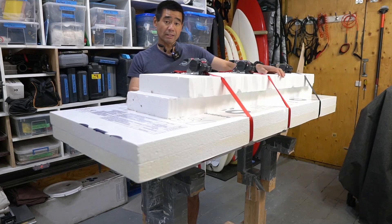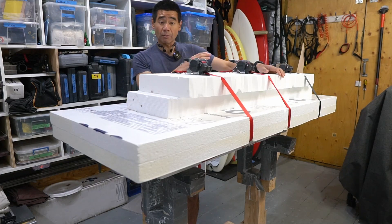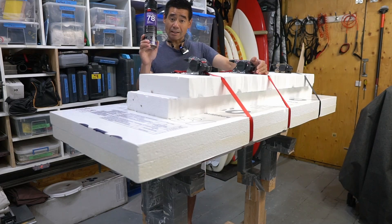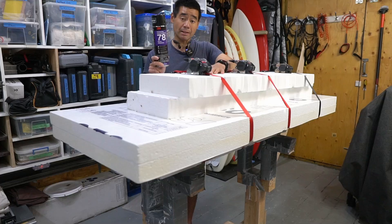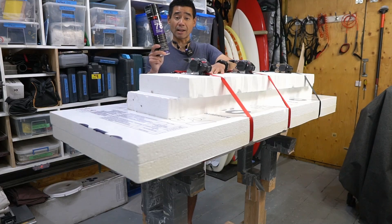So that's how you glue EPS, XPS, and polystyrene together — this is my new method. I hope you enjoyed this video and found it useful. You could use some of those other methods if you don't feel comfortable using 3M 78 spray adhesive or are worried about the toxicity. It's the purpose-built product for gluing this type of foam together and it works really well. I recommend it, just with some safety precautions. See you guys in the next one.